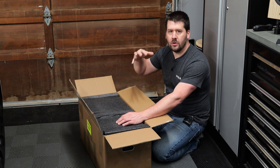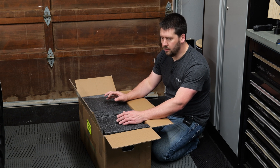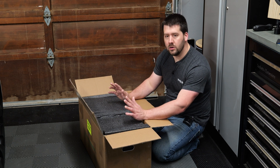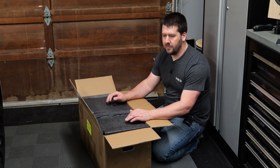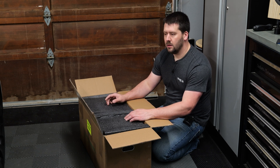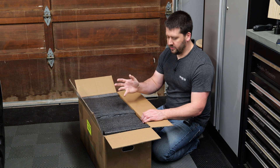They deliver 230 volts to the house to aid in transmission — higher voltages can go longer distances without losses. They step it down to 115 volts because that's safer if someone were to get shocked. Most houses will have some 240-volt components: for me that's my electric oven. Others might have an electric dryer, electric stove top range, electric hot water heater, or electric furnace — all of those things would typically be 230 or 240 volts.